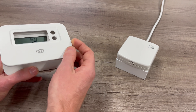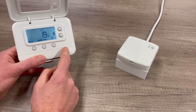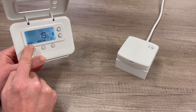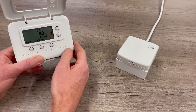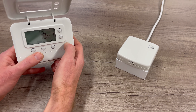To start with, we need to open up the screen and then press any menu key. This will bring up the user display and you'll be able to see that you've got menu, auto and off. What we need to do to enter the pairing menu is press the minus button and the menu key at the same time, and press and hold them for a couple of seconds to enter the menu.